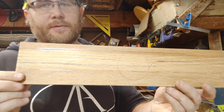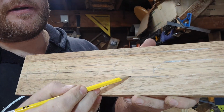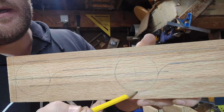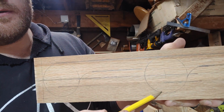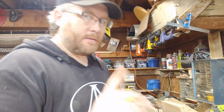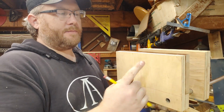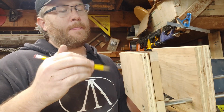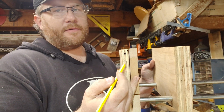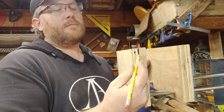Be the cams that I just drew out. This line here, that's 3/4 of an inch off from the outside edge of each cam. 3/4 inch, 3/4 inch. Because I'm going to cut slots in here for the cams to rock inside up against this inner piece. And this board is 3/4 of an inch thick, so it has to be at least that thick,